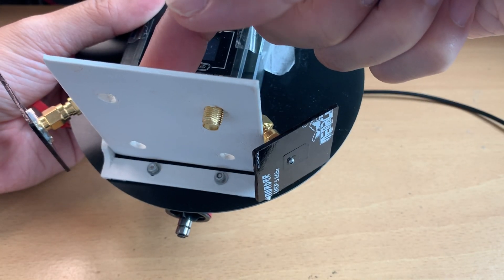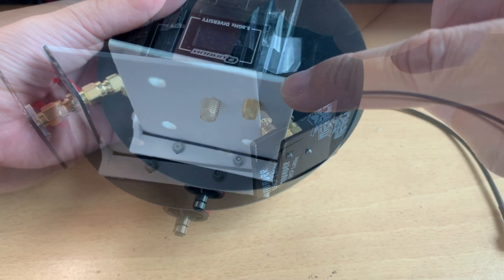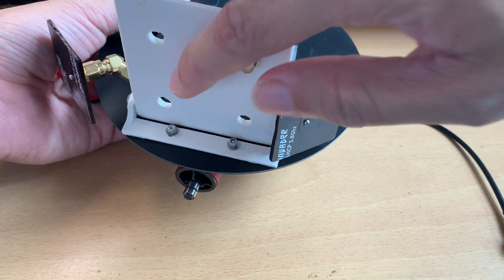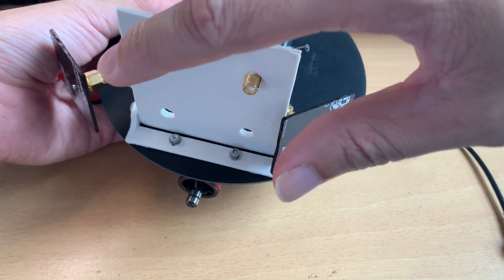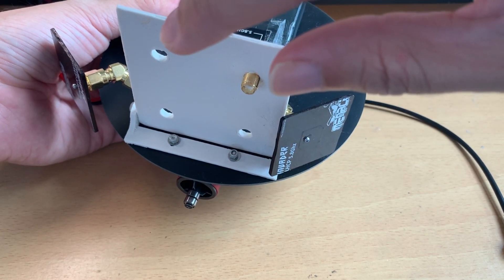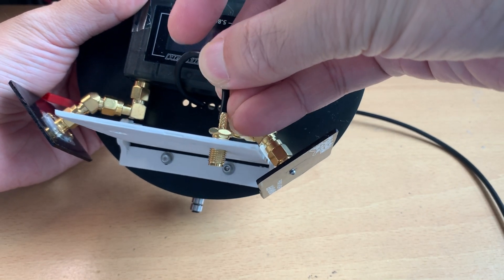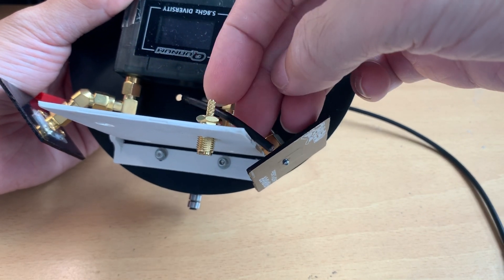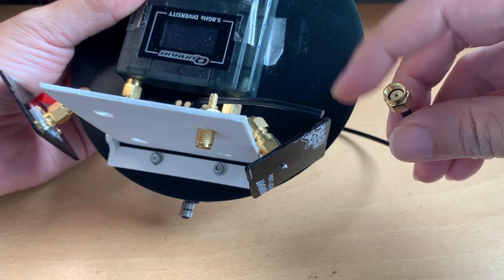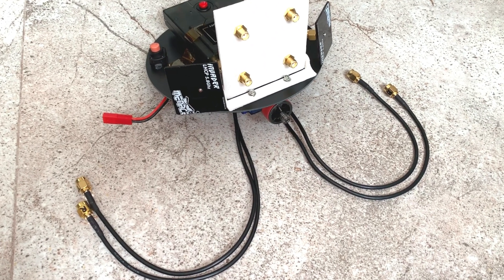I also 3D printed a holder which will hold the 4 antennas connected to the DJI goggles. Eventually I will have 4 SMA ports here, allowing me to hook up 4 patches for the DJI goggles. The patches connect to the DJI goggles via coaxial cable, which runs through the holes here. This is the other end that we plug into our DJI goggles antenna port. We now have all 4 SMA connectors soldered to the RG174 cables, and here are the 4 patches installed — they look lovely.